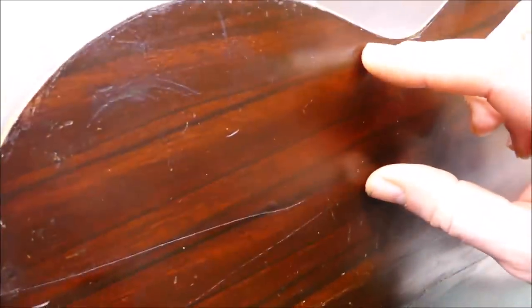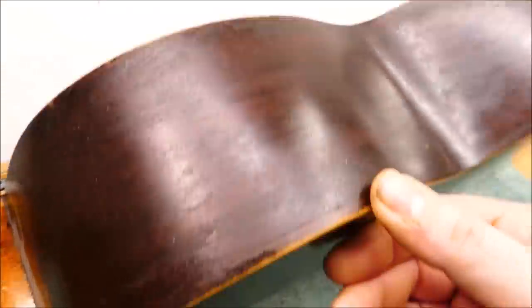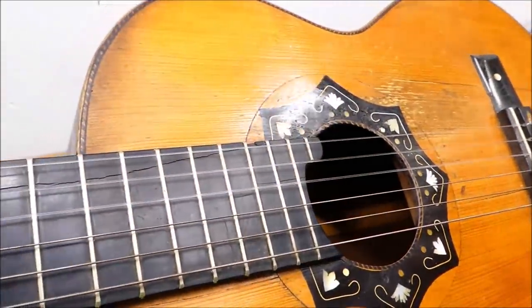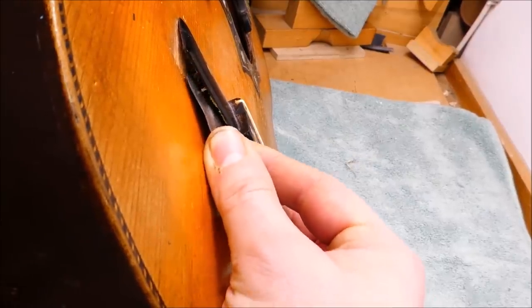There are numerous side crack repairs and back cracks. This back is really interesting in that it seems to be made up of strips that are about two inches wide — it's a pieced-together back — and the whole thing has been stained dark brown. You can see how it comes over top of the binding; the binding was stained along with it. There seems to be some lighter color wood under there. There's a crack in the fingerboard to take care of. On the inside it looks pretty standard — a seven-fan system with no cutoff bars — but what's interesting are these little buttresses up against the lower transverse bar, really tightening that center area up. Louie Panormo did something similar; these may be a later addition.